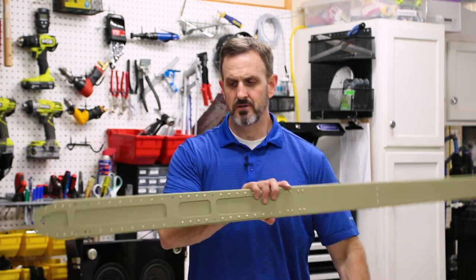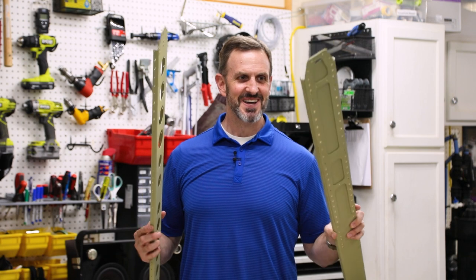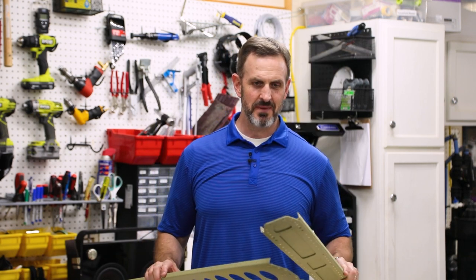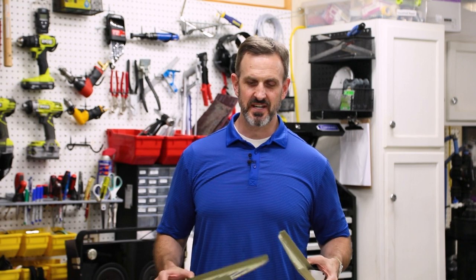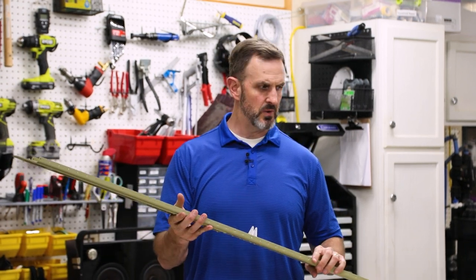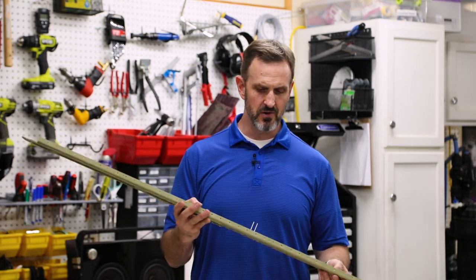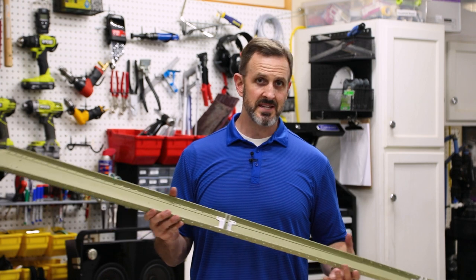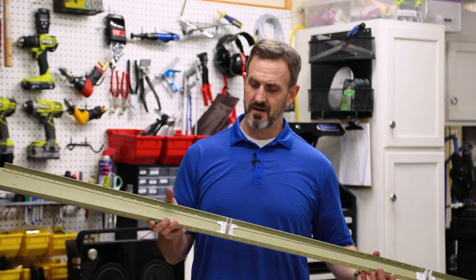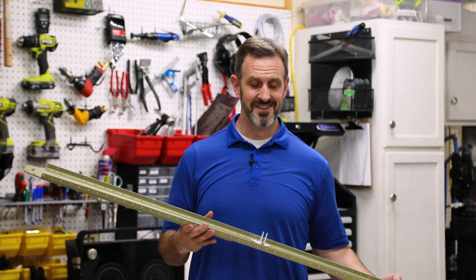So after 32 hours of work, I've got these two parts right here. I used to think I could finish this airplane in about 3 or 4 months, but it turns out it might take more like 5 or 6. I don't know. Anyway, next time I start working, I'm gonna have to put together the skeleton and put the skin on the vertical stabilizer. That is actually going to involve bucking rivets with a rivet gun and a bucking bar, which I didn't have to do on here.